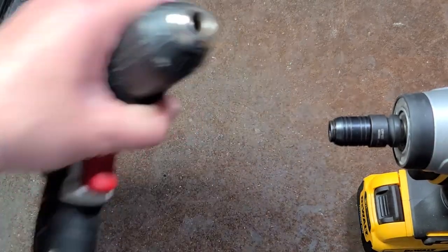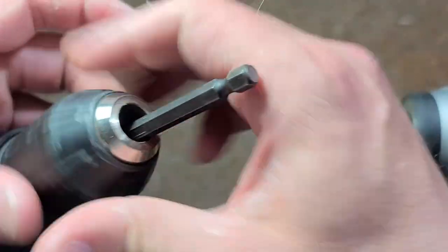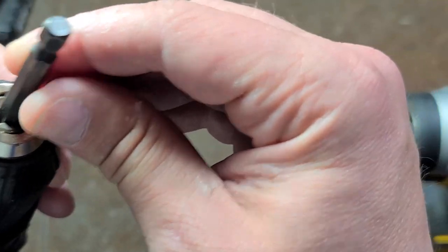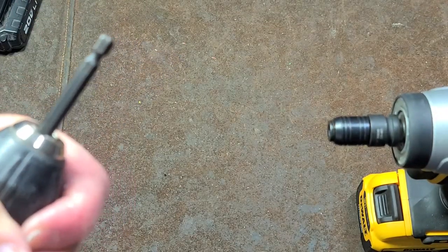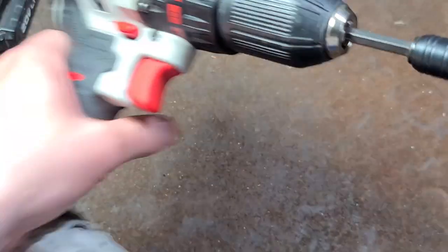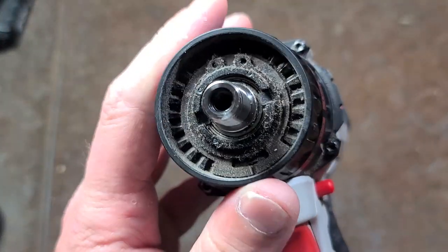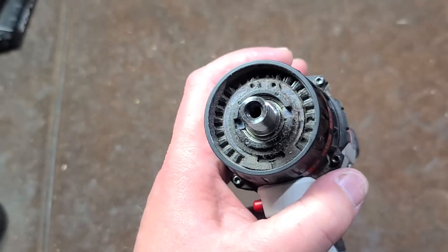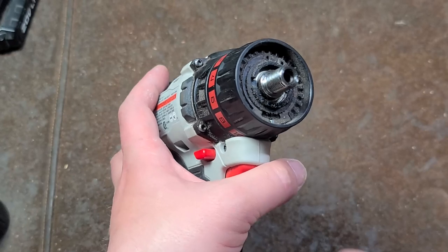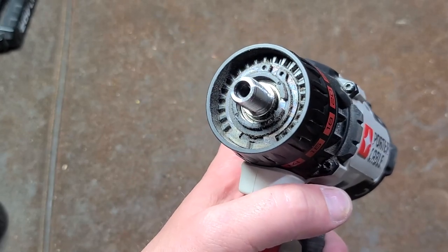This little adapter from Performance Tool — the three-eighths to quarter-inch drive impact adapter — sucks because you have to pull on it to release it and it wants to just pull off the tool. I would avoid that one. We'll use a hex bit that goes all the way through; it's an impact one so it should be pretty strong. And the chuck will come off normally, left-loosey. That just flew right off with no effort whatsoever. Not all chucks are like that — some are nearly impossible to take off.